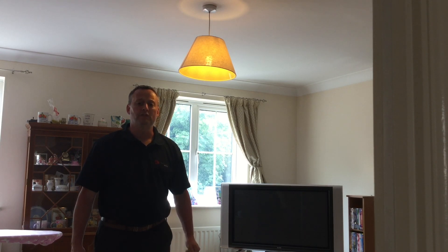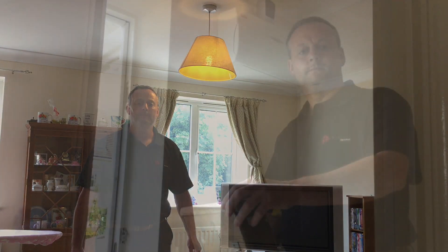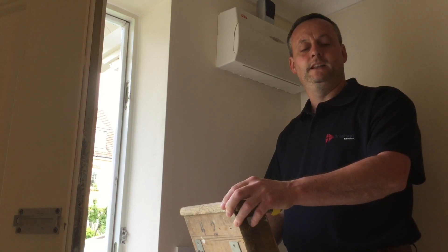We don't really want to start probing on to a circuit to prove it's energised — we should use visual clues. Is the TV on? Is the washing machine working? Is the cooker clock on? In this case, is the light fitting on? So we leave the circuit on before we go through the isolation procedure. It makes it easier for us to see that the circuit has been de-energised and therefore turned off. So we've left the light fitting in the on position.